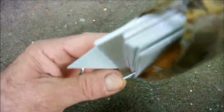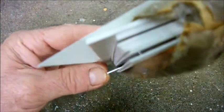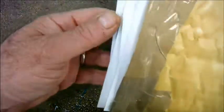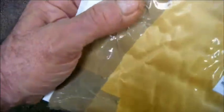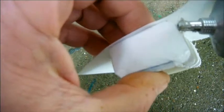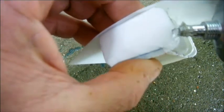My mixed pack of styrene sheet contains all sorts of varying thicknesses, from 2mm, or about a 12th of an inch, down to 0.5mm, or about 20 thou. So as you can see, the thin one is almost as pliable as a sheet of paper, and it's this that I'm going to use to sheet the outside of my tanks. Now we'll see how flexible the stuff is.